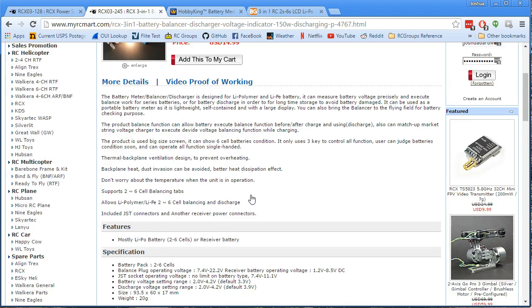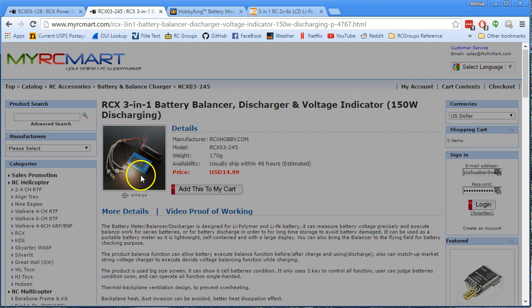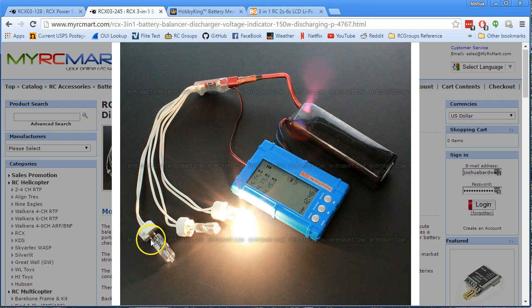The other thing this does that is really cool is it has an external port that you can plug into — it's just got to be a transistor or something like that. And you can use these halogen bulbs, which are the exact same ones that I bought to make my battery discharger for my battery testing. Basically, this will trigger the external discharge and run the battery down until it reaches a predetermined level. That is really nice because this thing itself can act as a battery discharger, but it can't dissipate much heat and it's really slow. But if you buy this with the external kit, it's great as a battery discharger because the light bulbs are the load dissipating the heat, and this thing is just acting as a trigger to say stop. Fantastic.